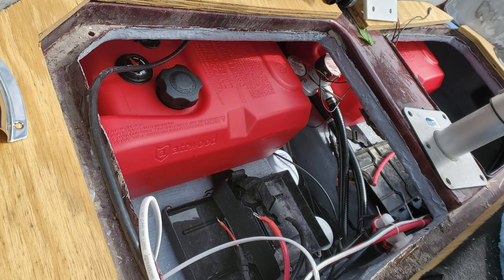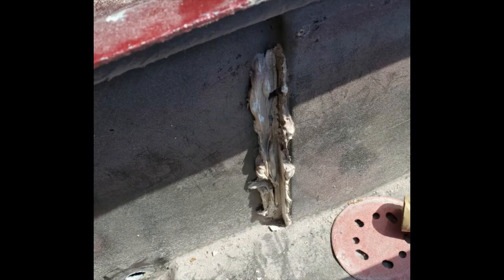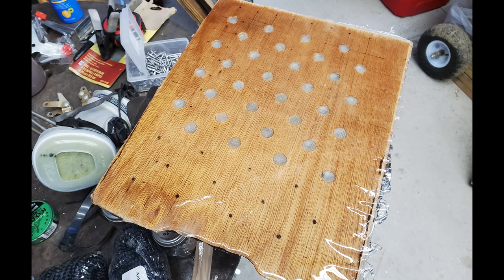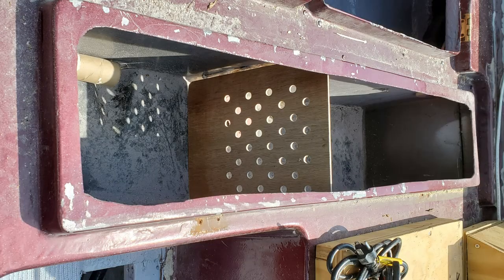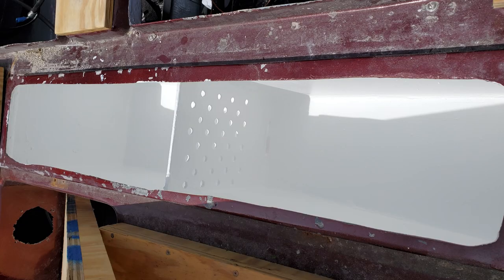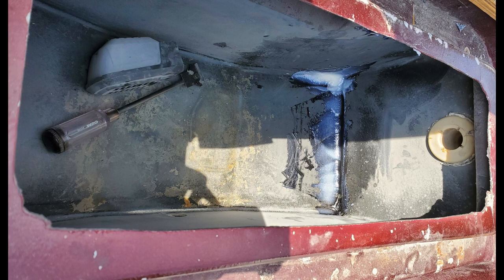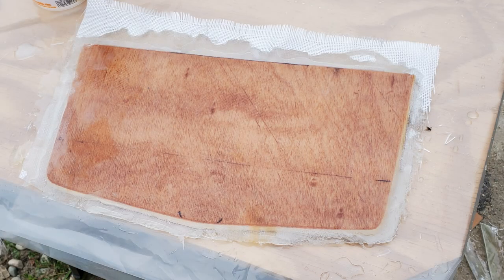In the stern compartments, the dual fuel tanks were fitted with tie-downs, each having a replaceable inline filter that goes to a selector valve and then out to a quick connector in the motor well. The interior of the livewells was pretty disgusting — I ended up removing a baffle in the aft well that had been poorly secured with about two full tubes of silicone. This baffle is actually really necessary to minimize slosh in the tank side-to-side, so a new one was made out of 3/16ths luan that was glassed and fully encased in resin, then tabbed into place permanently with fiberglass strips and thickened epoxy. The whole compartment was sanded and gel-coated white. At the bow, the small livewell had some signs of cracking in the corners, which was also repaired and re-glassed, a similar baffle installed, and it was gel-coated as well.